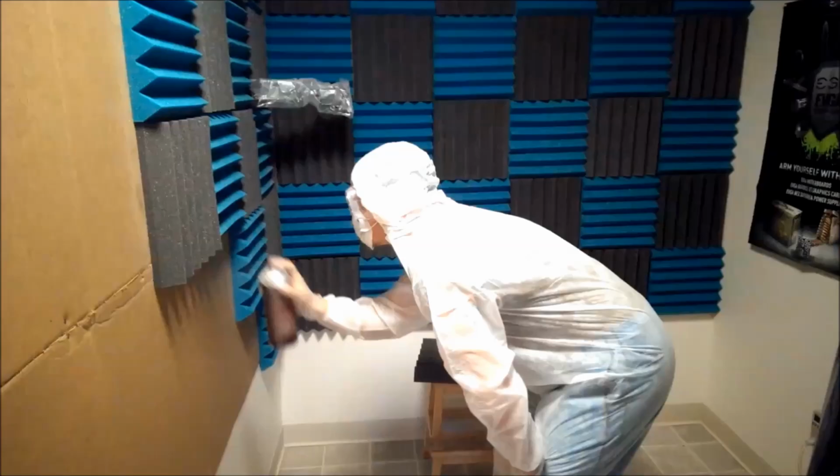I started off by hanging corner tiles top to bottom and center out. I highly recommend them, they're cheap and they're worth it. If you plan on hanging tiles on the ceiling like I have, I would recommend doing the ceiling first. I did the ceiling last. I ended up with a lot of adhesive on the remaining tiles on both walls. It doesn't look nice, it actually looks like they're dusty.